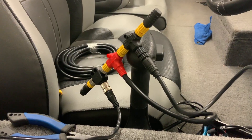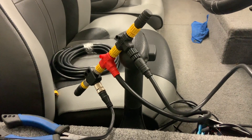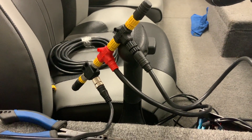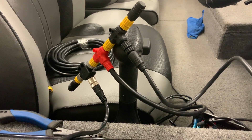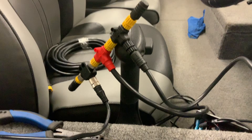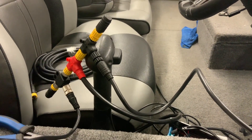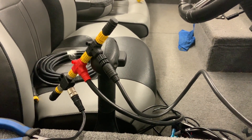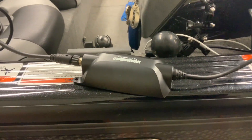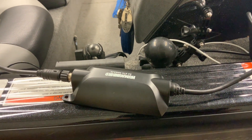The NMEA backbone is something you can get from different companies — it's not necessarily a Mercury part or a Humminbird part. No matter what brand of sonar you use, if you're hooking it up to your outboard you're going to need a NMEA backbone like this — it's just a different kind of cabling. The gateway plugs into the NMEA backbone. That metal connector on the left comes with the Mercury gateway. The red drop-down T connector is for power, because your NMEA backbone needs to be powered.